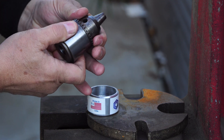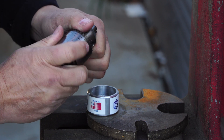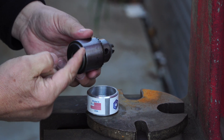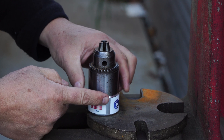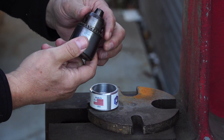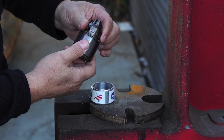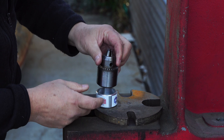Now for the 6A's, unlike some of the other chucks like the Super Chucks, you need to have the jaws about half open so that everything can clear when you're pressing the nut off. Sometimes if you put them all the way down they'll hang up on the sleeve and cause you to cuss. Sometimes when they're all the way out it's hard. It's pretty stable about halfway out.